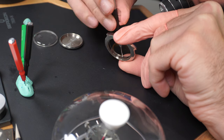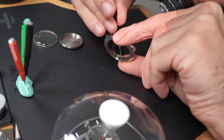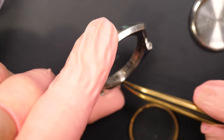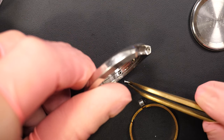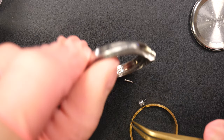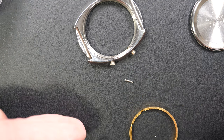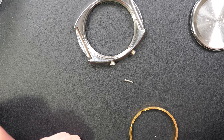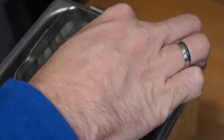Now removing the case and you remember the pusher was a bit weird - almost off and it looked bent. Removing the screw that keeps the pusher in place. So that's the pusher - the screw is fully bent and the pusher is on the side. It's fully damaged, I cannot fix it. So I'll look for a new set, and I managed to find one for a good price - I couldn't find a hand, but I found a pusher. There's a special tool to remove the pusher - screwing this part which is threaded in the case. That's the whole old pusher out, and here is a new one. I got a full assembly, so I'm changing everything.